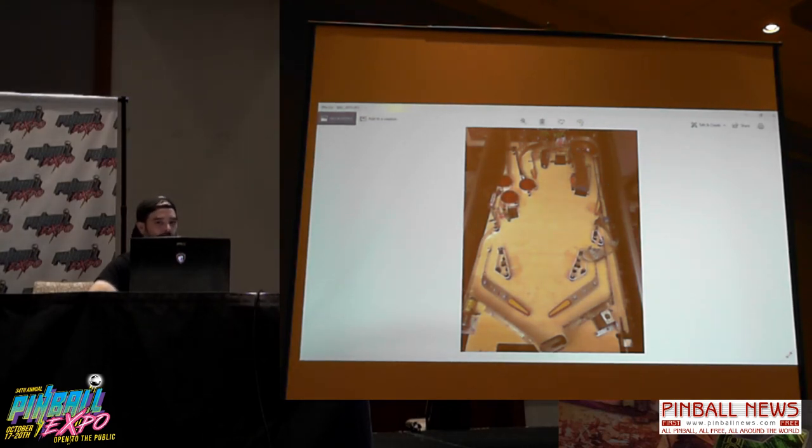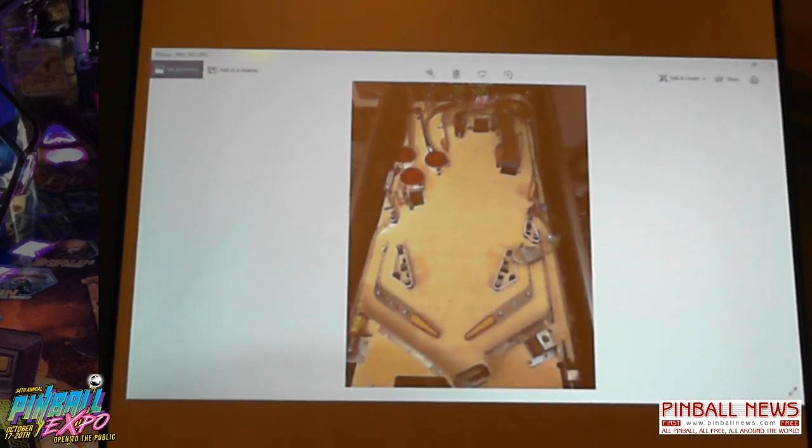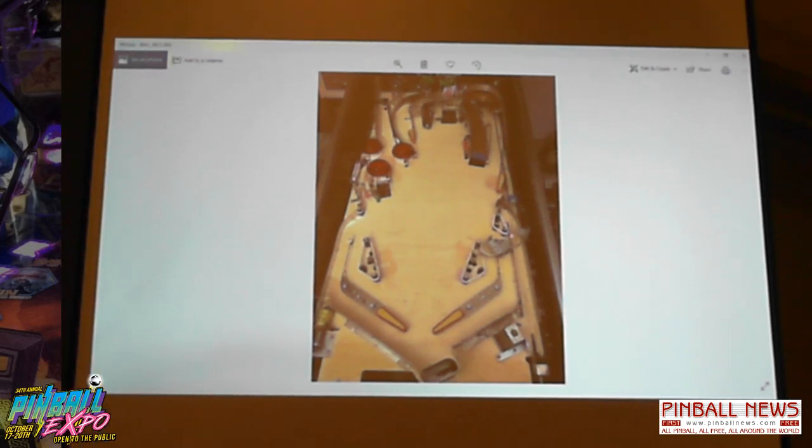Now you see some really rough prototyping of the right ramp. We've got some wire form coming down here and this ugly little plastic drop-off ramp here. So I found that I got a sheet of acrylic from Home Depot for like $5. And this was a great way to prototype the ramp. That's much better than the wood here. So basically, just cut this out. I think I used just the jigsaw with the metal blade. Cut it out to the shape I want. Use the aluminum guides and a lot of duct tape. It works. So as you can see, it looks terrible, but when you're just prototyping the shot and the ramp and how you want it to work, it's great.